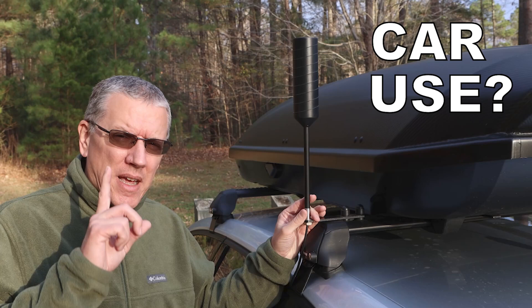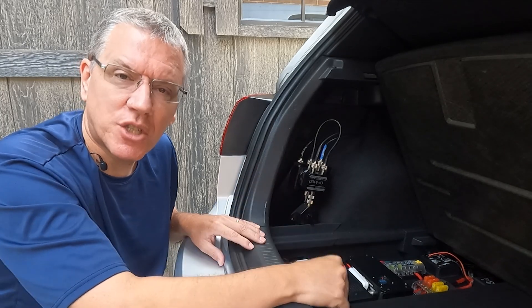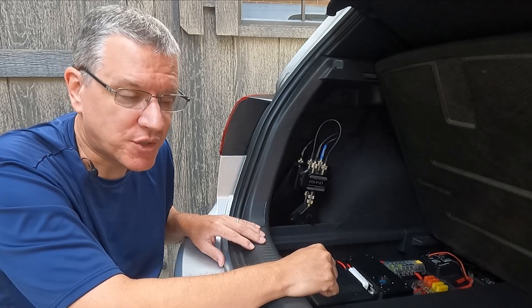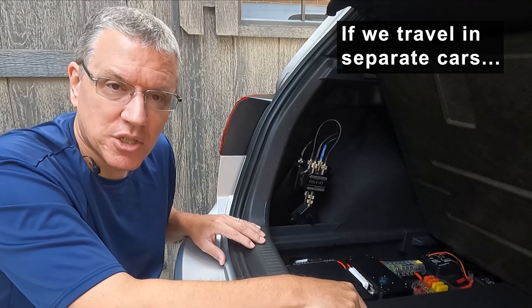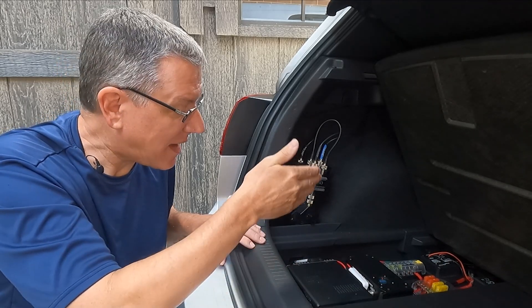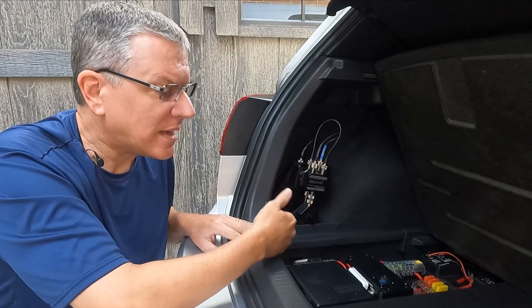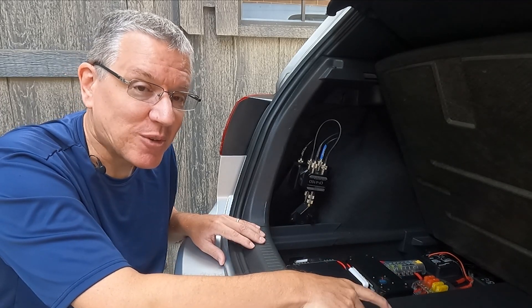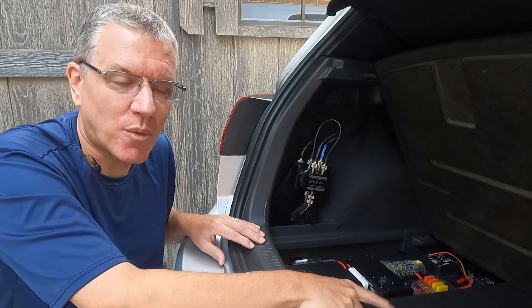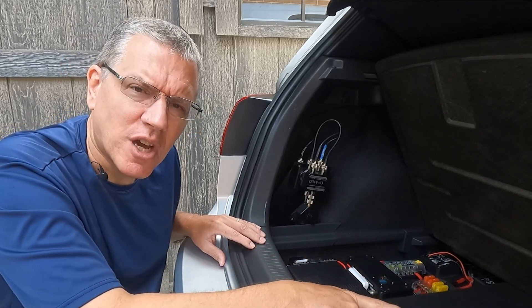That is the complete path for putting four transceivers to one antenna port. The WeBoost antenna is really its own separate, automated system. Now, some of you may ask: why go through all of this instead of just putting one RF switch by the driver's seat to select between ham radio and GMRS? The problem is, if I have GMRS selected — say I'm traveling with my family — I'd have no access to ham radio without cutting off GMRS. By doing it this way, I can monitor two meters and GMRS simultaneously. I can only talk on one at a time, but I can manage both and decide which way to go.